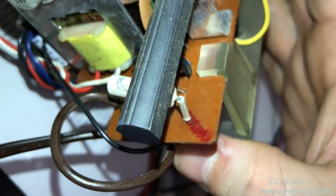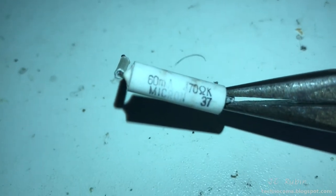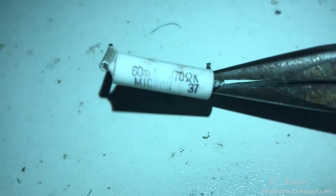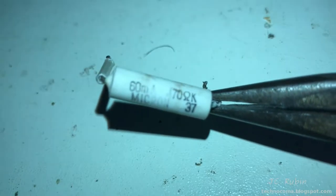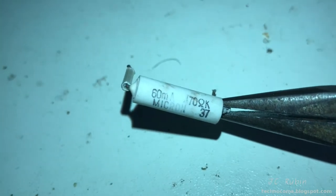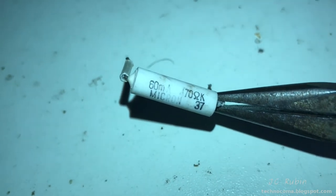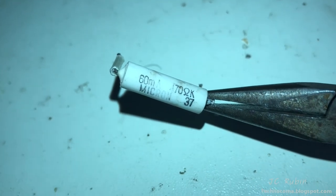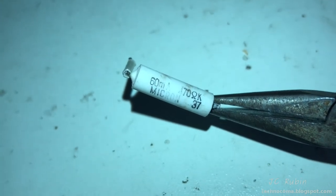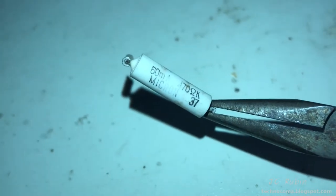that's too bad. Looking at the schematic, I've confirmed this is a 470 ohm resistor. The 470K is poorly placed on this thing. I couldn't tell if it's 470K. But when you look in the schematic, you realize that there's no way you're going to drop 470K right off the mains. Would be insane. It turns out this is a 5-watt resistor. All of the current that goes through this radio has to pass through this voltage dropping resistor. It's a very poor design.